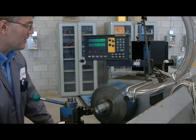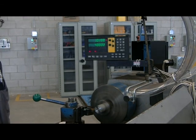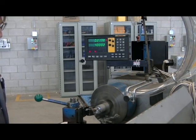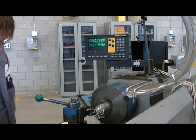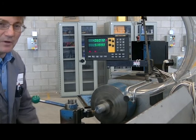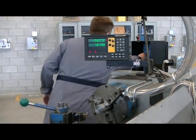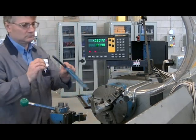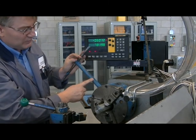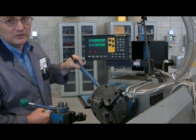I don't need to stop and re-measure. I'll get to 4 inches and I'll set it to save time. Stop it at center, get away from the part. Then we'll shut off and take it out of the chuck. I only leave the chuck key in the chuck when my hand is on it — never leave the chuck key in the chuck.